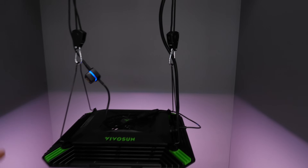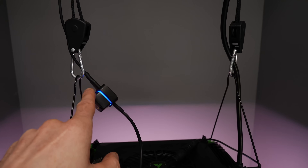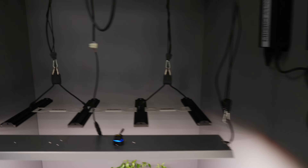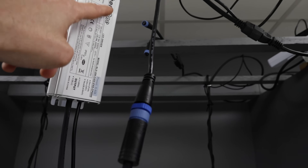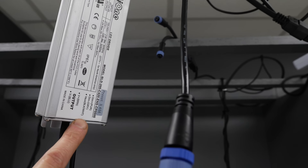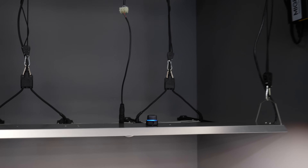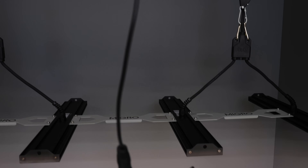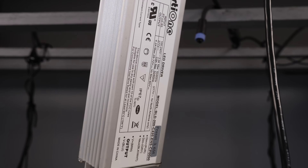This one is the Vivosun — sure they won't like this, somebody else controlling their lights. But this one again needs the USB-C power connector and the type one connector, plugged straight into the lights. And here's one I show just as a demonstration of wiring it directly. The Horty One shows the connections here — the dimming connections, it does have the power connector. You can see down here the Growcast, and I've just made a connector for it with the DIM plus, minus, and the power feed back to the grow light.